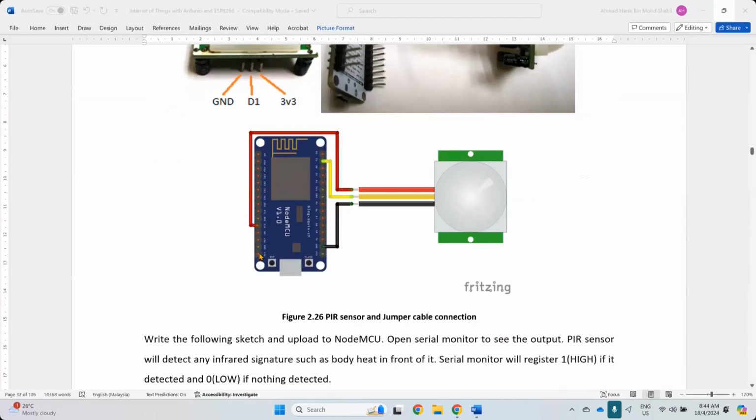You can combine this with the sensor here. When the sensor detects something, you give the instruction to turn on this relay. For example, if someone comes into the room and the sensor detects someone inside the room, it turns on the relay. The relay is connected to whatever you want, but you have to hack your way into the electrical system of the house or your room. So this relay is a very useful output component, because it outputs things. Just set digital write to low and it will turn on; digital write to high, it will turn off. High and low are reversed.